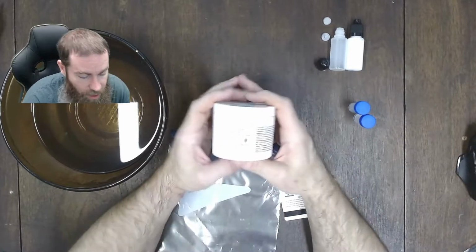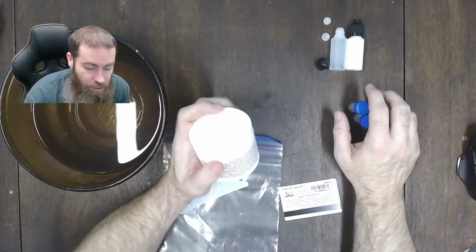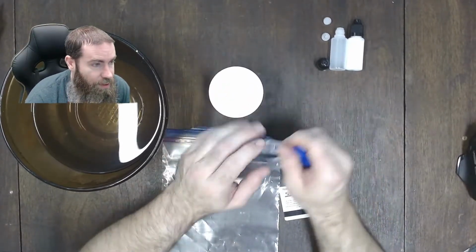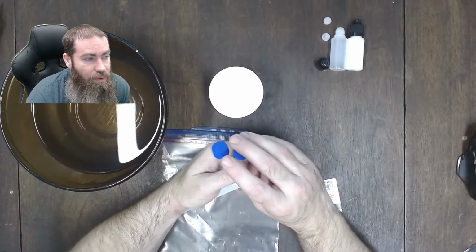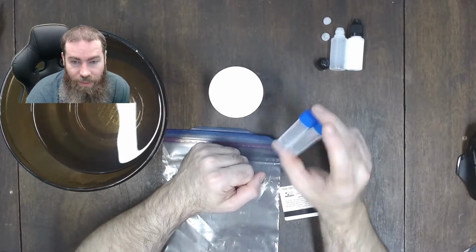So we've got our Molykote EM-30L here. I'll add some links in the description for places where you can purchase this. And then the oil that we're using to thin it is a PAO oil, a PolyAlphaOlefin oil. This is Microlubrol MicroSyn 1000.